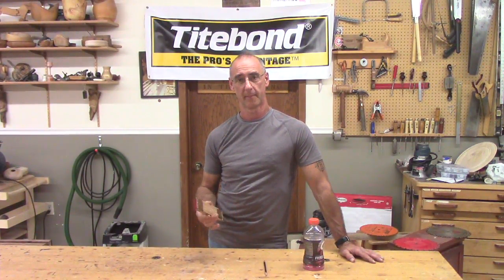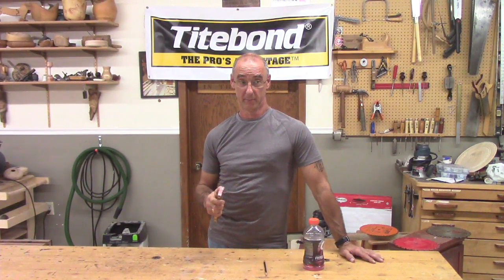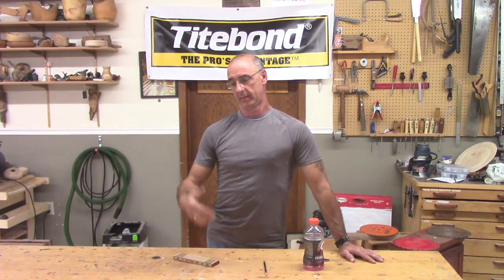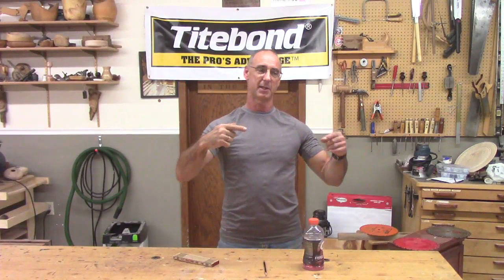Johnny said, you just said you cannot run end grain through a planer. Why? Because it's bad. What happens is that when the planer knives are cutting end grain, they have a tendency to not cut so much as catch.